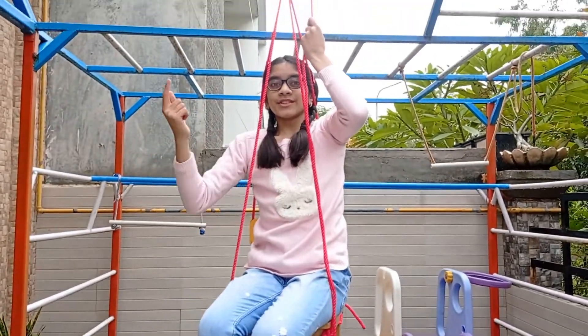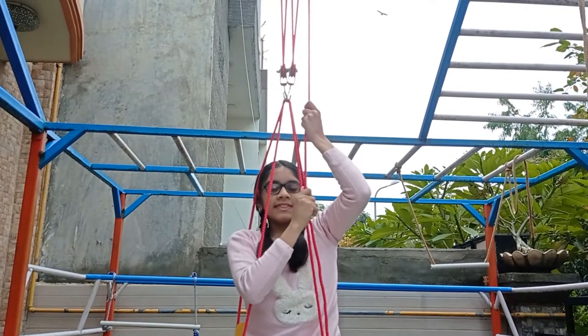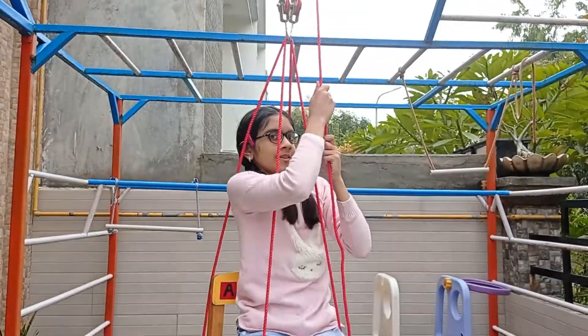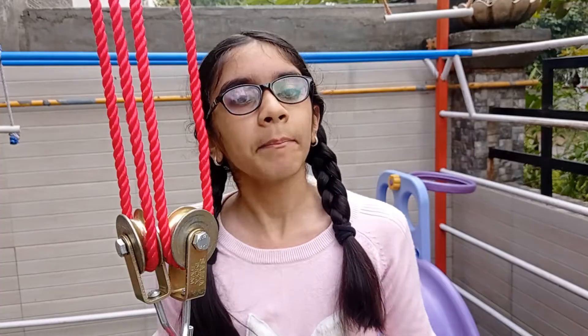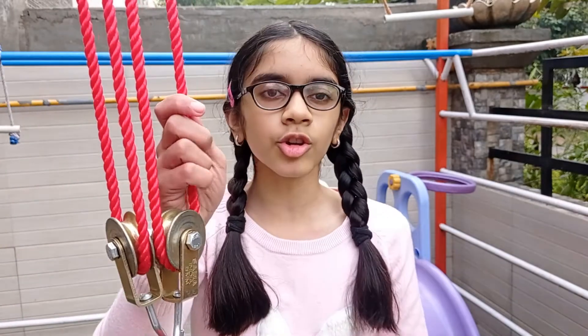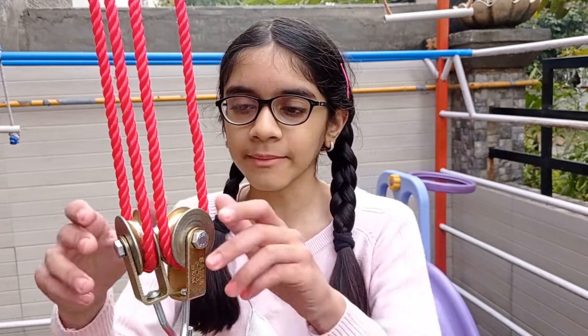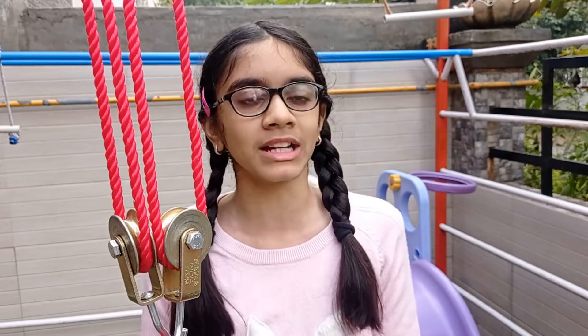The credit goes to this simple yet powerful machine — the pulley. In this video we are going to talk more about pulleys. A pulley is a simple machine which consists of a wheel with a grooved rim in which a rope can run to pull heavy loads. Pulleys can be used to change the direction of force, or provide mechanical advantage if multiple pulleys are used together. Mechanical advantage is a measurement of how much a simple machine multiplies a force.